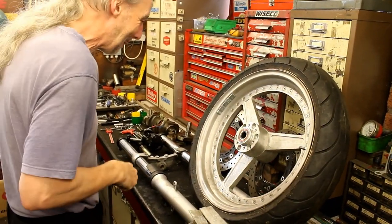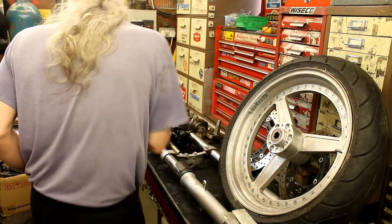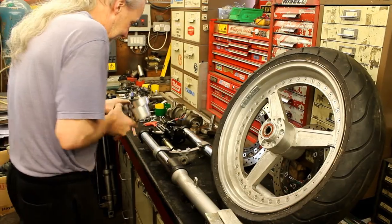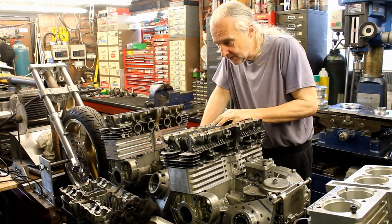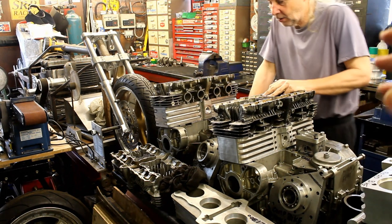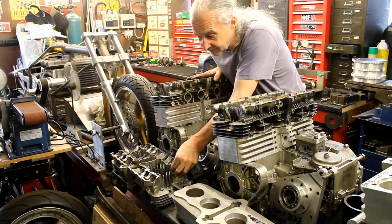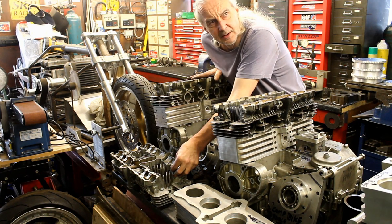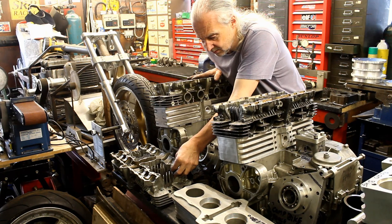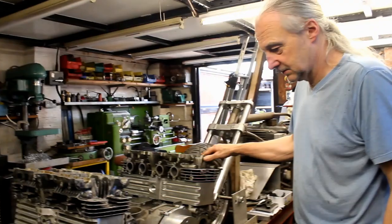That's a lazy way of polishing - you just hold it and stand there drinking tea while it polishes! We also can't use a stem on that set of R6 yokes because we've got the stem in here already - that's one reason why we change over. Right, I think that's about it for this week. The head - you mentioned last time you've sorted out the problems with the cam bolts, greased through them all, so now it's ready to go off for new valve guides, new valves, and having the valve seats recut. Then it's going to get painted gloss black.